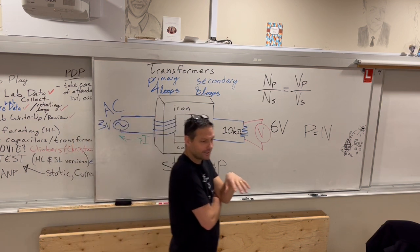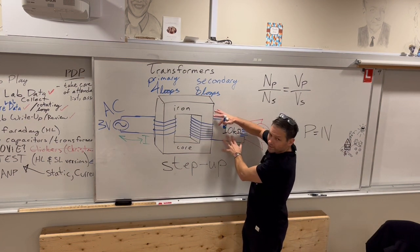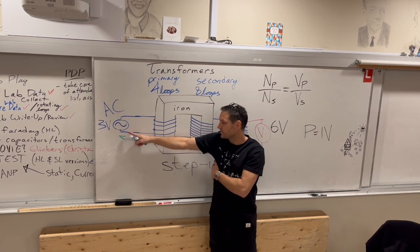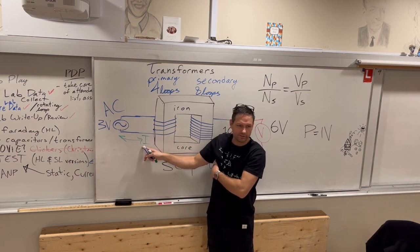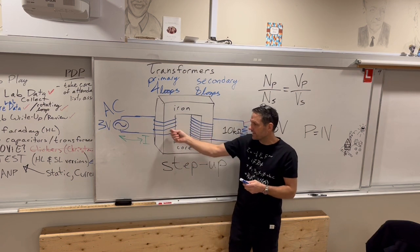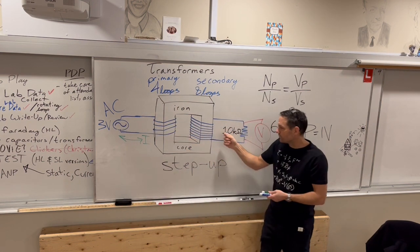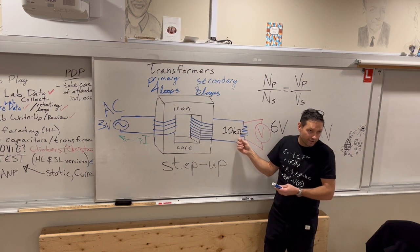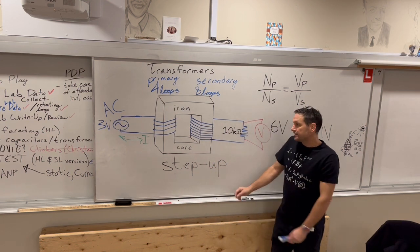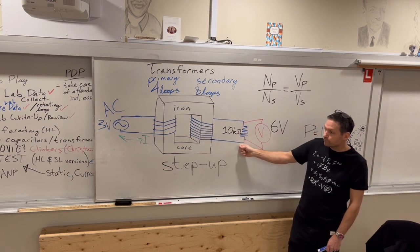No, it's 600. Good, I'm hearing a few of you arrive at the proper way to do this. If we don't know anything over here, could we just find the current on that? No. Could we just get the resistance of this coil and find the current? No. This is weird, because even though this is not connected with a conductor, this is still kind of pushing through this resistance over here. We're changing the magnetic field back and forth, but we're still shoving it through there. And so we have to use this resistance first. You find the current in this loop.